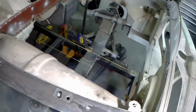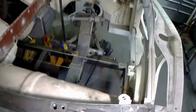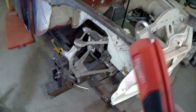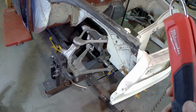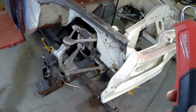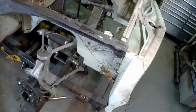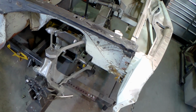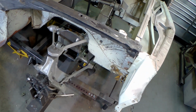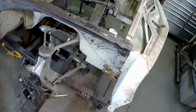Any measurements that I was doing alone in the garage were I guess a little unhelpful, because I thought everything was fine. But anyways, when you get a little wheel base difference, in other words, that girder across the middle is not perfectly square to the car, and everything's welded in a little not perfectly square to the car. So I'm just going to fix that. The original idea was actually to try to tack weld this thing up in the car. I think I would have just become very frustrated with that. So we're going to do it all up on the bench and make sure it all fits in nicely.